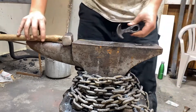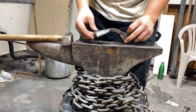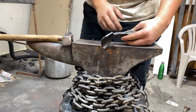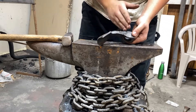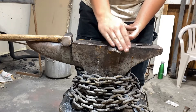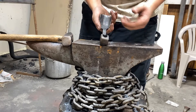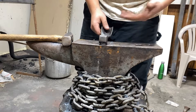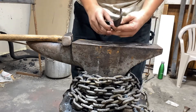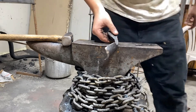This is the basic shape that I'm trying to achieve. As you can see, I need this wide piece and that's why I'm drawing this middle portion out. My plan is to draw this out first and then flatten this portion, get it shaped how I want, and then move on to punching the hole — so that this stays intact in its most original form without getting deformed too much by all the work going on here, grabbing it with tongs, etc. The first step is definitely to get in that taper.